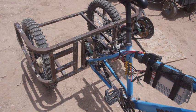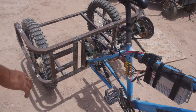Because, yeah, I could feel it even going downhill. I could feel it was slipping. This is the thing. Keys are what we need. Keys, key shaft, keyways. I can't do that. I could probably grind a key into the shaft, or that other shaft that I had keys in, but it wasn't long enough. But I don't really have a practical way to make a keyway inside of the fitting. Eventually I'm going to switch this out and put keys in, but I've got to figure out how to do a keyway into that.